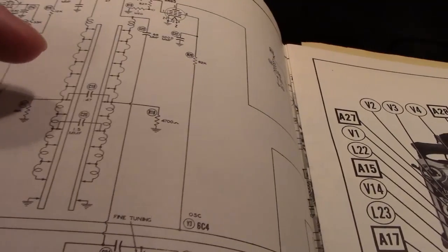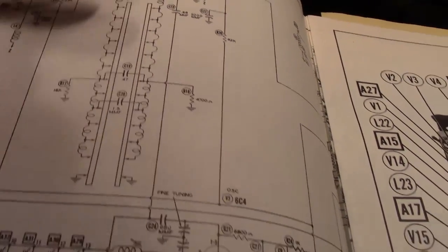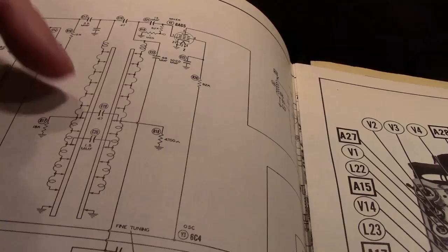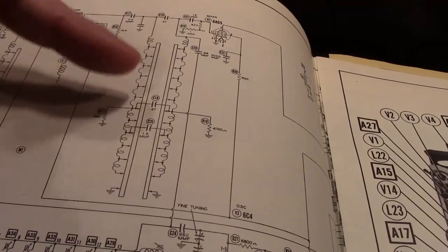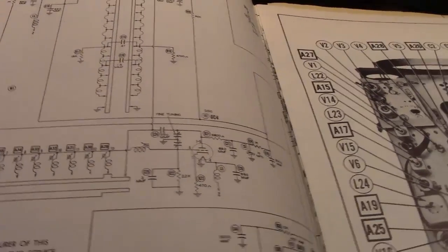But also notice at a couple points, you switch in a 0.47 in parallel with that guy, and here a 1.5. Well, I'm going to double check on the picture. Is this really C18 or C19? At any rate, by my replacing it with a larger capacitance value, I've thrown off this bandpass action. However, the set does work.